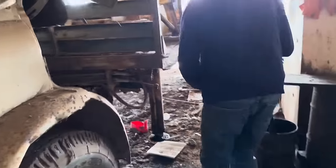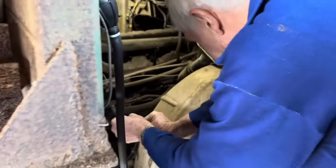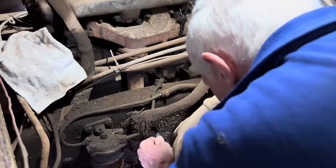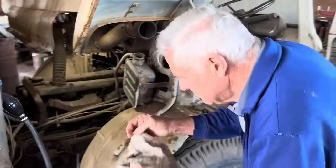Find a spot where we can set our tank up. Let's see if we can get diesel coming out of there. Right, that's tight on there — it won't need a clamp. So we've got the fuel system hooked up to our auxiliary tank now. We always just have a little bit of fuel doctor additive in with the fuel. So if there's something a bit sticky in the injector pump or anywhere along the line, it may just help free it up. Some people would say fat chance, others would say at least there might be some chance — so we'll work on that.